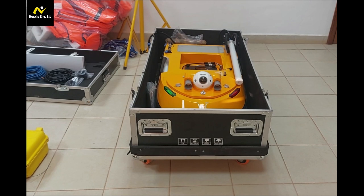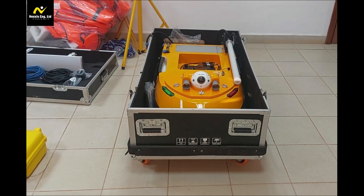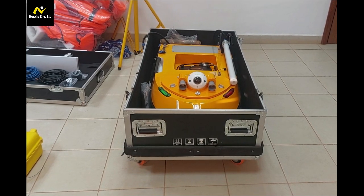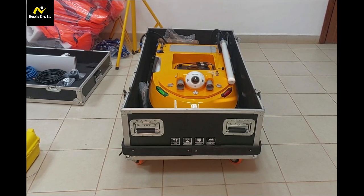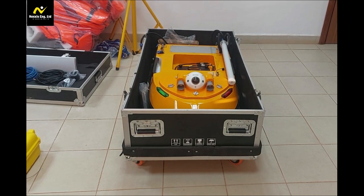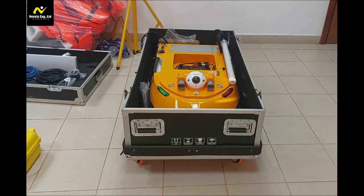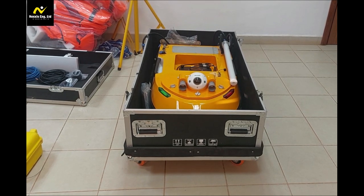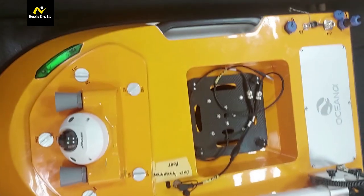Another unique function is the autopilot function, enabled by the SL20 to navigate a planned line, or as we call it, a route. It also comes with a base station that provides data telemetry and Wi-Fi to communicate with the USV in autonomous navigation and transmit back to the shore when it is done. It has a wireless station software called OceanAlpha, which allows for mission planning and full control of the USV.